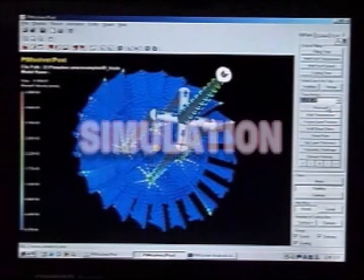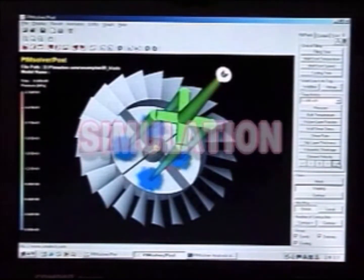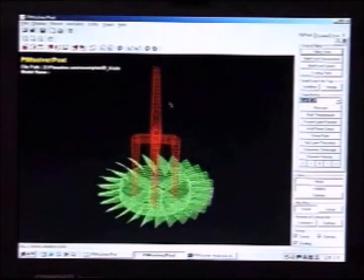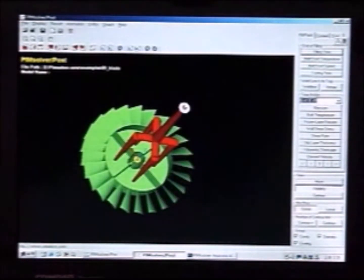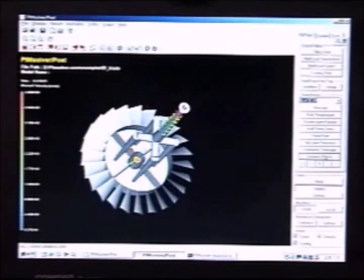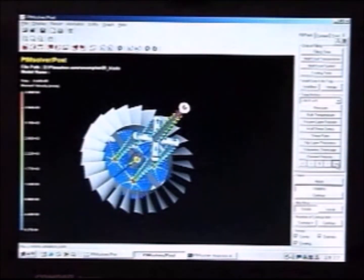Software simulation researches. The researchers at CISP try to utilize the CASE software not only to develop the parts successfully, but also to reduce the developing time and cost for high-precision PIM parts. The CASE software has several functions such as geometry modeling, treatment of input data, simulation of each step, and display of results.